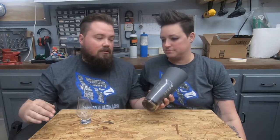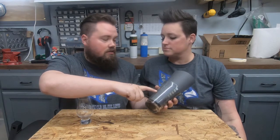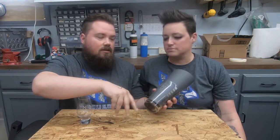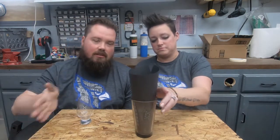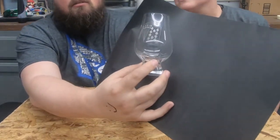Awesome. Looks great. I ran this at 70% and about, I think, 750 millimeters per minute. And I actually had to increase the lines on it because it was making weird little jumps when the line is too straight or not quite straight enough. So I added more lines in it to get the detail in there that we wanted. So after doing that, I went ahead and threw it on the Glencairn and the cards.